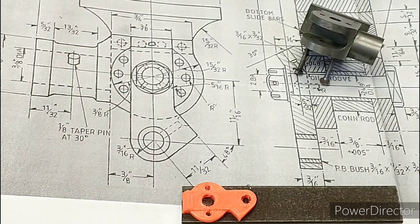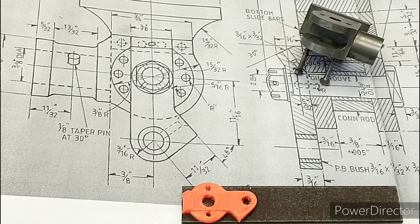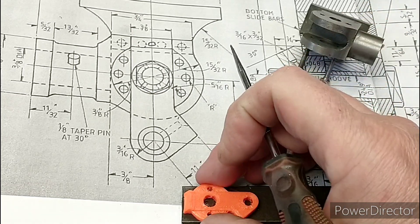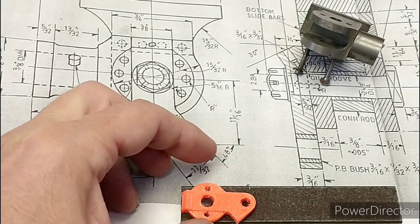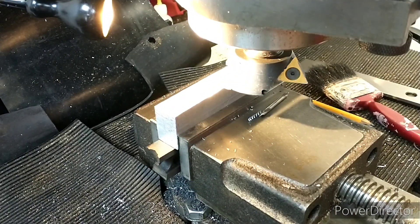It's something I need to improve on, but for the time being we'll have a go and see what happens. Maybe super glue will be strong enough, maybe it won't. I can put a flush fitting pin in these holes and that will stop any side-to-side movement - most of the milling forces are going to be sideways so I think that would work. I've got a block of aluminium here that I've chopped up on the bandsaw - I'm going to face it so it's nice and parallel, then mount the work to that block as a sacrificial piece.